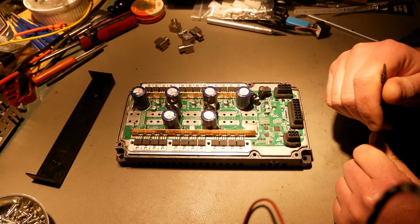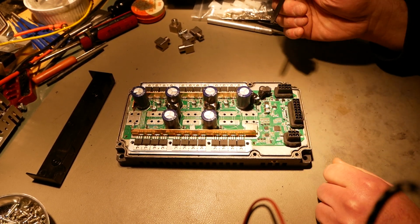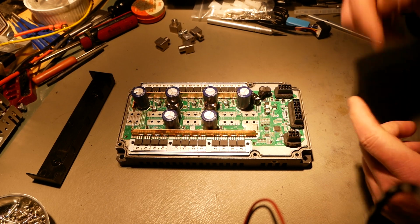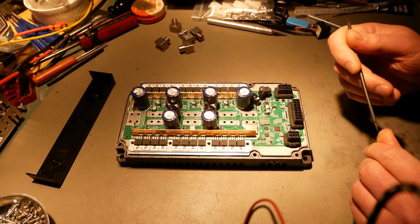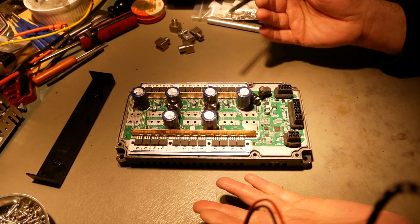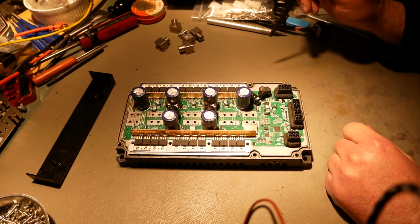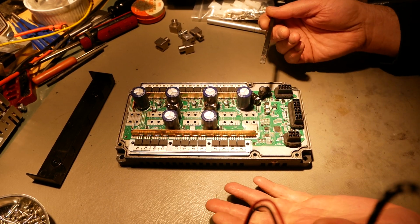There are libraries for FOC control for this chip, but this is a sinusoidal controller. That was Votol's choice to go that route. I don't know why they did or didn't, but if you look at the documentation, there's no evidence that this is FOC, and also if you look in the setup app for it, there's no indication in there that it's FOC.